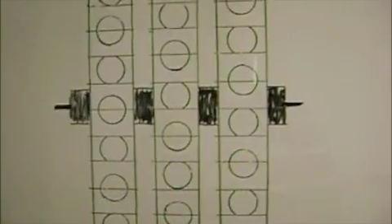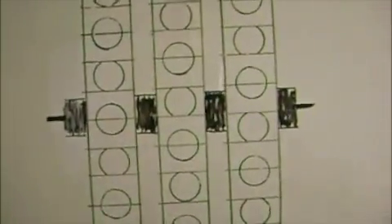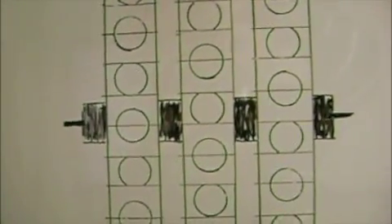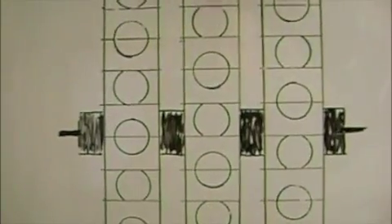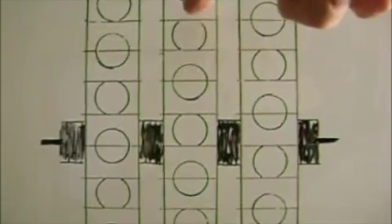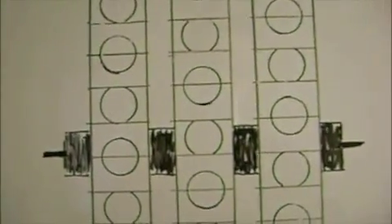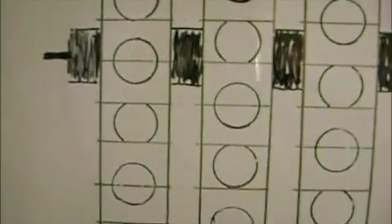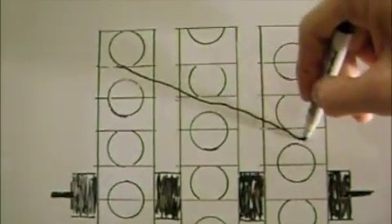One of the few things in this assembly you don't have to question how it's put together are the rotors. The rotors are put together with this basic spacing. Each one has magnets that are about one inch in diameter by one inch in length. The first rotor at the bottom point of the first magnet will line up with the top point of the magnet on the next rotor, and so on to the third rotor. Basically it forms a perfect line — almost like lining up one long magnet by doing it this way, the staggered effect.